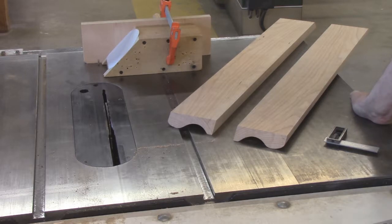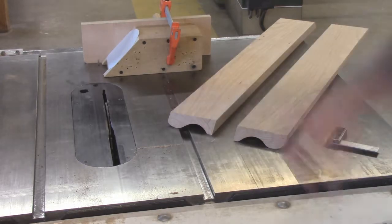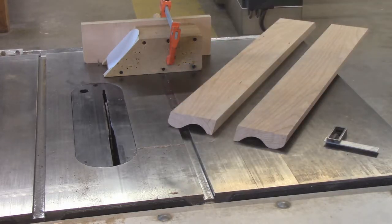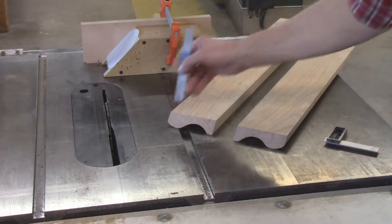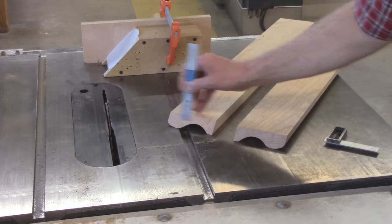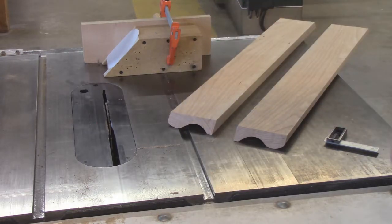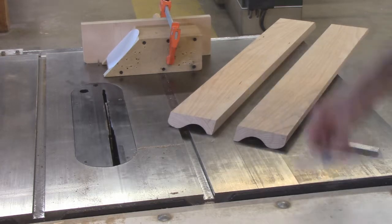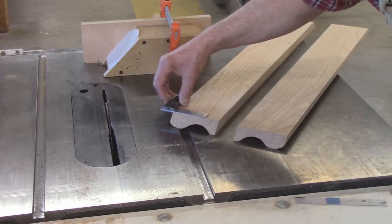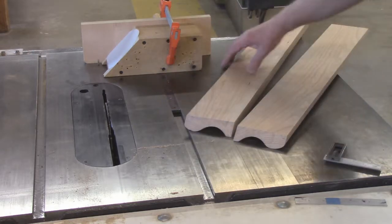So to regurgitate it back to you, these need to be flat. You need to make sure there's no cupping, because they'll rock in the fixture. If they rock in the fixture, the groove will not come across evenly. It might come up heavy and go across and create all sorts of problems. So these need to be flat, and this miter needs to be square. That is critical.